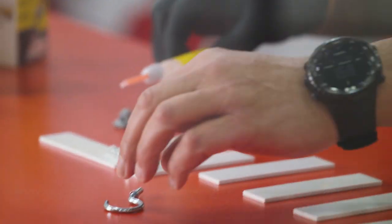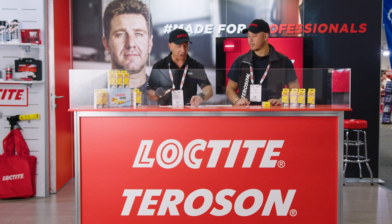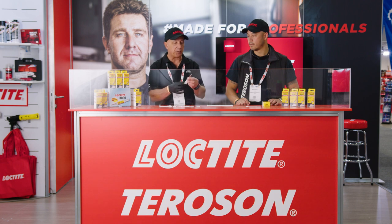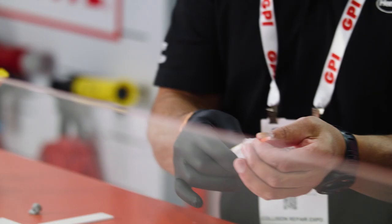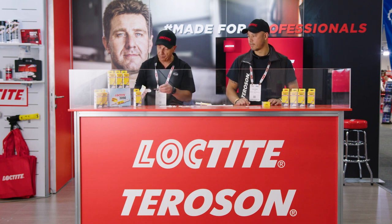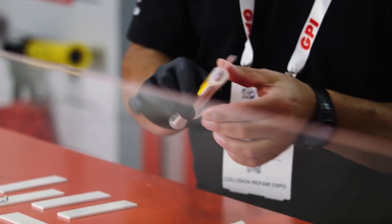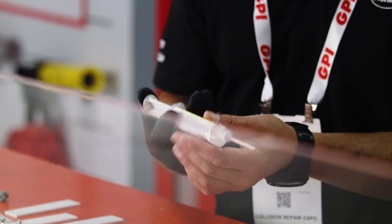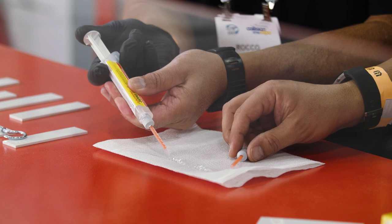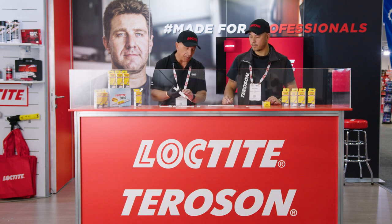I've bonded one just previously. I'm going to demonstrate what I mean by gap fill — we're using this hook to demonstrate because when putting this component together there's going to be a fair bit of a gap to fill. Now an advantage with this product is that it comes with disposable nozzles — a self-mixing nozzle. The packet comes with about half a dozen, so it's all serviceable out of one kit. It's always recommended with a dual cartridge to bump some out first to make sure the product has mixed correctly. We run it out about 20 millimeters to confirm both parts A and B are coming out mixed.